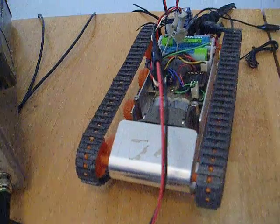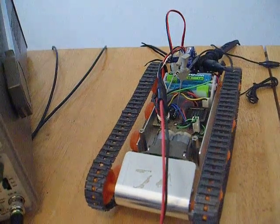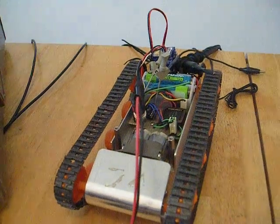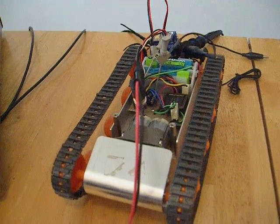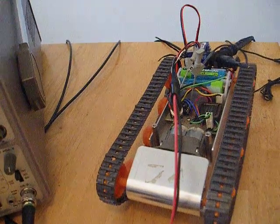And you can hear a buzzing noise. This is due to the low pulse-width modulation frequency I had to use, as these motors are hard to control with higher ultrasonic frequencies and the motors tend to saturate with higher ultrasonic frequencies.